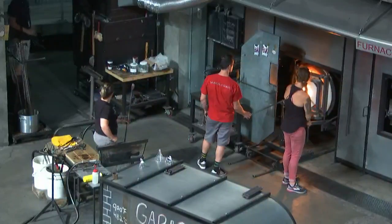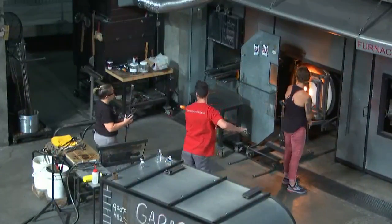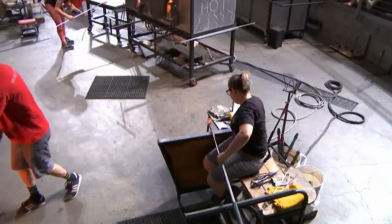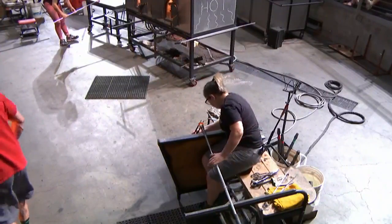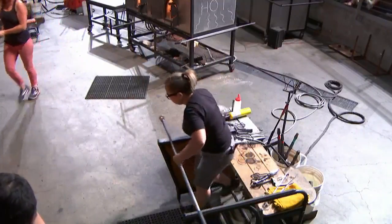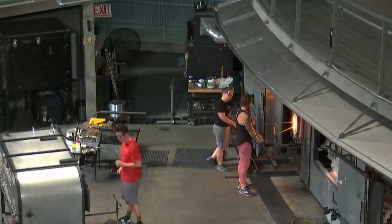All the glass that's in our furnaces is clear. It has no color. We buy our colored glass separately in the form of these bars. We buy them like an artist buys paint: red, yellow, blue, pink. We blow a bubble of clear glass out of our furnace. We heat up a little chunk of colored glass, and then we melt a layer of colored glass over the clear glass. We'll then dip that in more clear glass. So what you get is something that looks colored, but if you cut through it, you'd see it's just that one skinny layer. So if you look at this other sample here, this looks like it's made out of amber glass, but it's actually just a skinny lining of amber, and the rest of it is clear. But by the time you blow it out, it looks as if it's made out of colored glass.